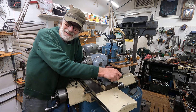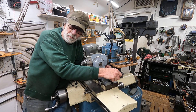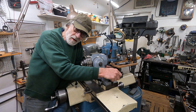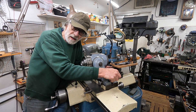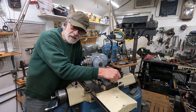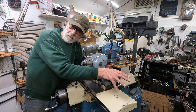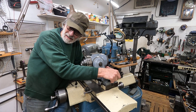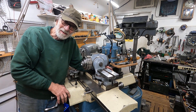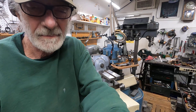My advice is kind of like the old milling machines where the vertical head attachments are worth more than the machine itself. So if I was looking for an industrial tool and cutter grinder, the first thing I'd be looking for is the work head — just keep your eye out. You can find a work head for 150 bucks, but if you buy a tool and cutter grinder first, that's when it gets hard to find a work head when you need it. So that's my advice: find a good work head — it makes things much better.